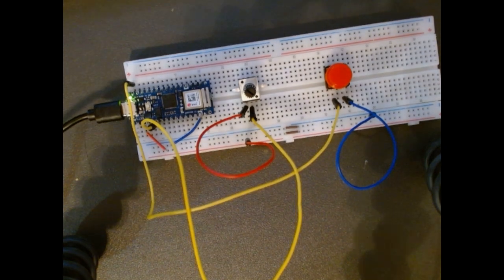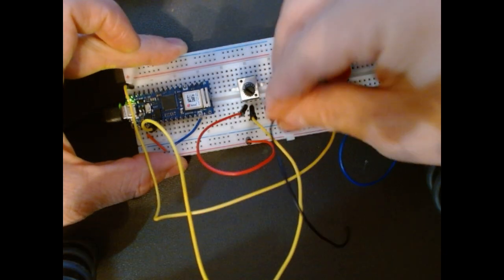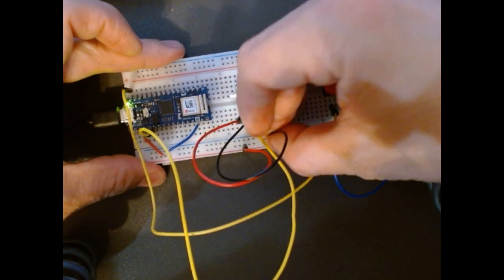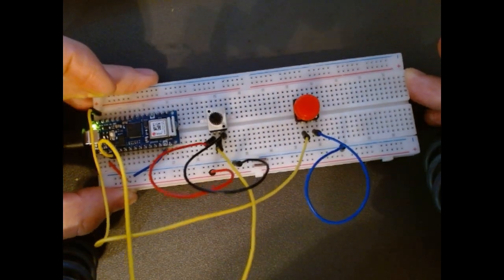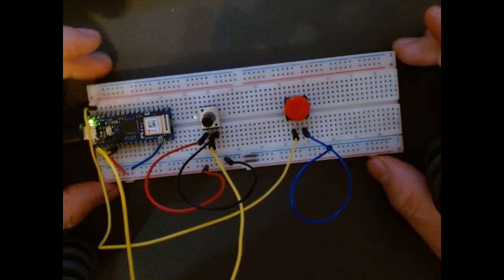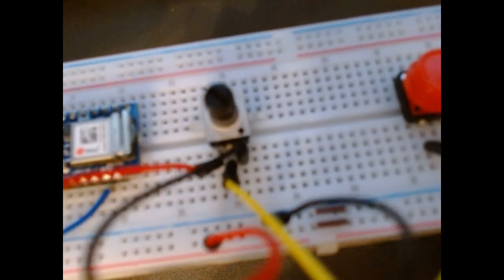The rightmost pin on the potentiometer is going to be the ground pin. So I want to make sure I'm connecting this in series with my negative rail on my breadboard. Okay. There's also a diagram I've included in the tutorial guide. This is a virtual diagram using Tinkercad, so that may be a little bit easier to follow along with as far as this patching process.